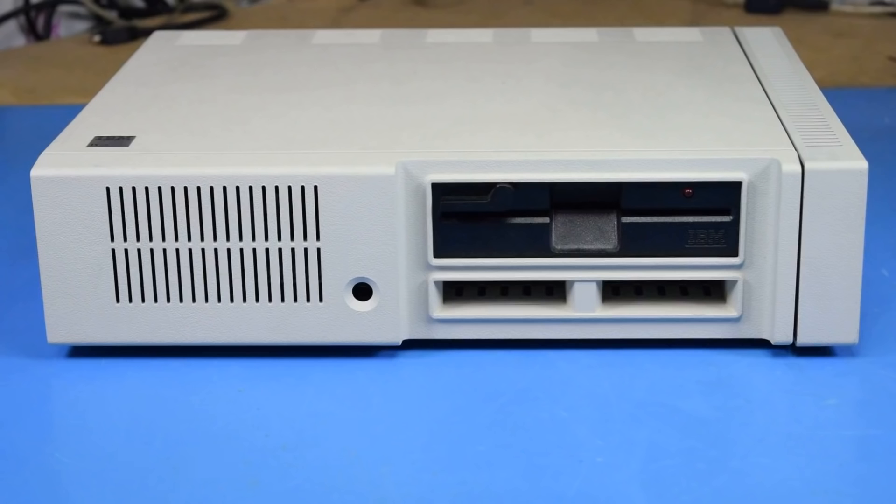Since I don't actually know if this computer works, I'm not really interested in buying one right now. So what other options do I have? I could try and find a less proprietary 18-volt power supply and see if I could get that working — it would need to be about 2.5 amps. I could also get a Variac that would let me adjust the AC voltage anywhere from zero to mains voltage, but those are even more expensive.